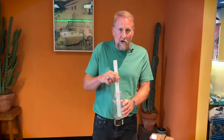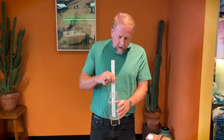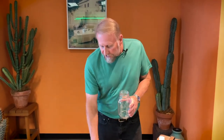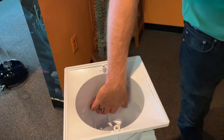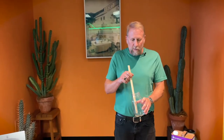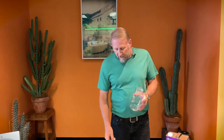The more stirring you do, the faster it will dissolve and mix. You can beat it and mix it to get it down to a nice paste. If we're doing a repair on the side of the skimmer, we may want the schmear compound to be more like toothpaste consistency so it won't run down and will adhere to the side. Keep in mind it doesn't take long — this schmear hardens very quickly. If we want it more liquefied, we can add a little more methyl ethyl ketone and continue stirring. You can even get it down to a syrup, which is better for pouring into the bottom of the skimmer on a flat surface as opposed to a vertical surface.